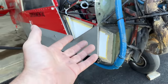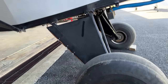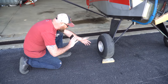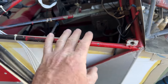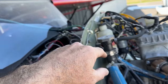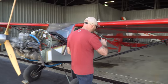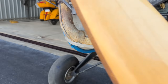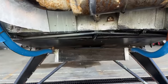It sat for a long time — somebody did fly this at one point. Looking at the tires, it's got a 20-inch tire on this little airplane, really made for off-field stuff like grass strips. I think the wheel is a Douglas wheel off a go-kart, so they steal parts from all kinds of different places. The tubes are thin but it's all chromoly welded. Other than that it's cloth and wood. It's got two fuel tanks, one in each wing, and you might burn two gallons an hour so it's really cheap to fly. This one does have an electric starter, which is much nicer than a pull start.